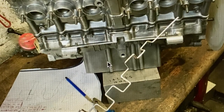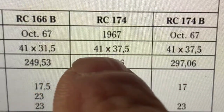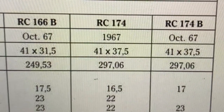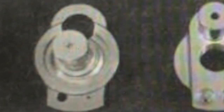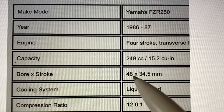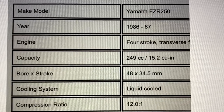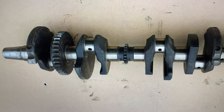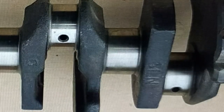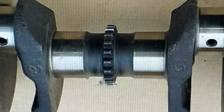I did some research and found out that the Honda RC174 had a 41mm bore and a 37.5mm stroke, and the individual crankshaft parts were really small. By comparison, the Yamaha FZR250RR engine has a much shorter stroke of only 34.5mm — that's 3mm shorter than the Honda — but the bore is 48mm, so although it might have a slightly deeper sound, it should scream. To get the sound I was looking for, I'd need to get rid of the standard Yamaha one-piece crankshaft and make my own pressed up crankshaft with similar dimensions as the original Honda 174 300cc crank.